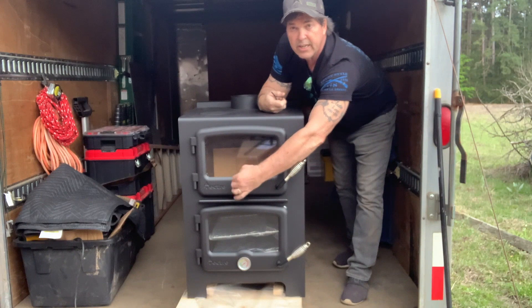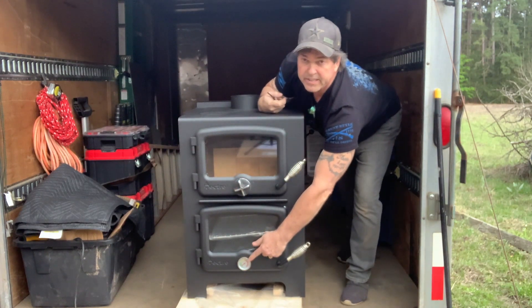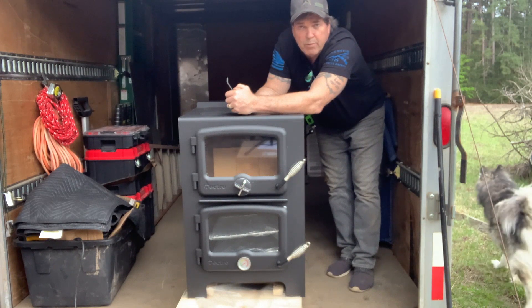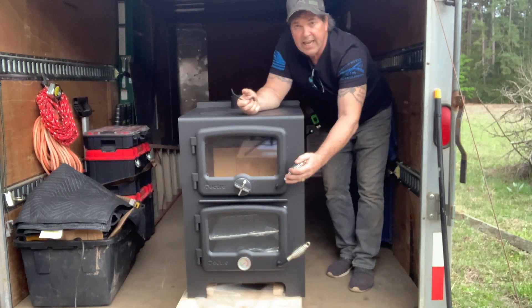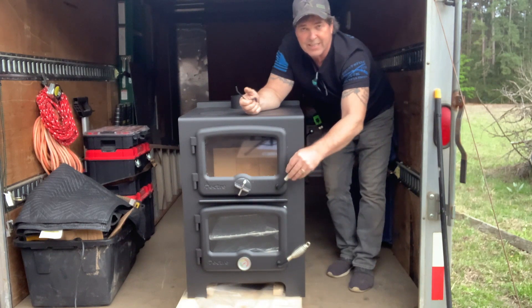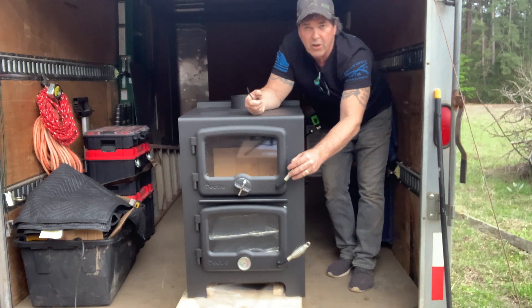You adjust your air intake here to get your stove up to temperature. This unit is not manufactured home approved because it does not have an established fresh air inlet on it. You'll have to talk with your insurance company to find out if they'll allow this in your manufactured home — insurance companies vary, so just call and check it out.